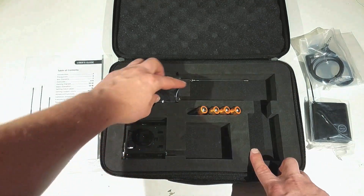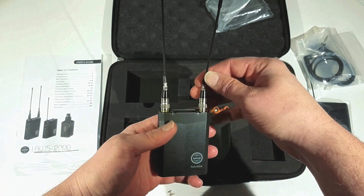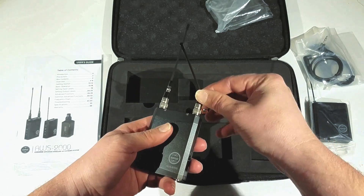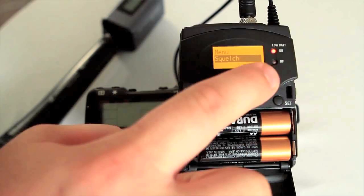There is one issue though — the scan. We're not a big fan of the scan feature. You hit one button on the very top, it does the scan. It finds the frequency — really does it in 15 seconds, just like they claim. It then picks the best frequency, and you sync it via IR with your transmitter. That's awesome. Except if you change the squelch settings on your receiver, it does not actually affect the scan. Like the G3 and G2, we know if you change the squelch it actually affects how many channels show as really free to you. Not a big fan of that.